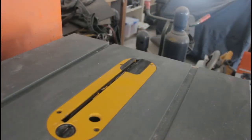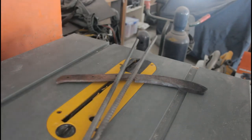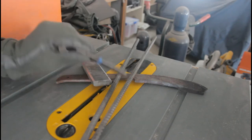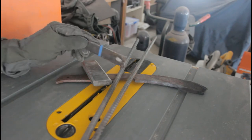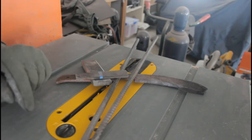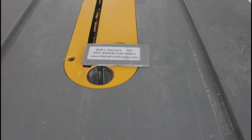Number three: don't bother trying to make knives out of scrap junk steel — old lawnmower blades, pieces of rebar, chunks of leftover mild welding steel, or even old files. Sure you can do it, but you don't really know what's in that stuff. Maybe you can heat treat it, maybe you can't, and it's really frustrating to spend days and hours making a knife only to get it all the way to the finished end and find out you can't harden it.